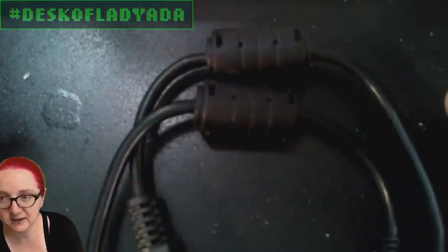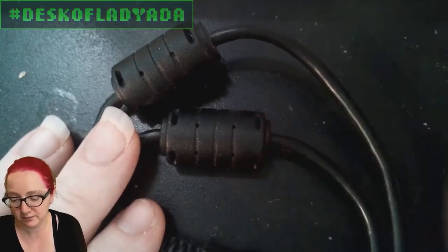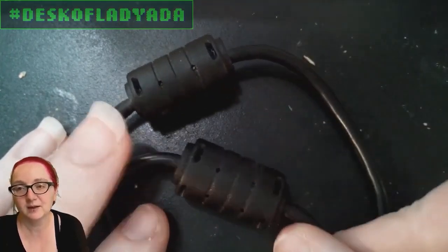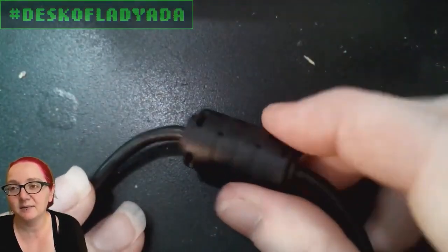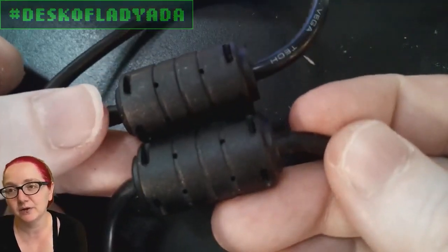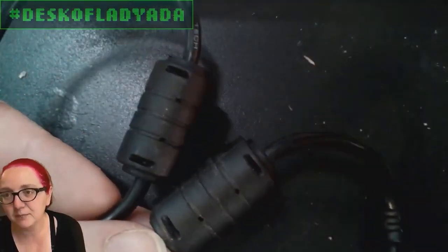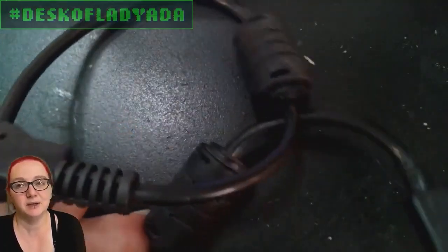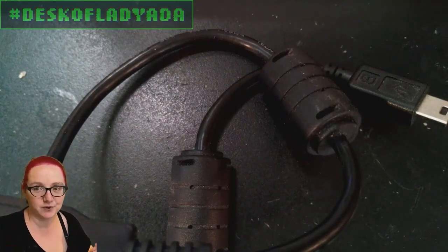So this is what you normally see — this is a USB cable. Although you don't see it as much anymore, maybe USB hosts or devices are better at reducing EMI in different ways, like inline resistors or lower drive strength. But this USB to Mini cable has a ferrite bead installed on both ends, which is pretty serious. Maybe it was required for the product this shipped with. These are molded in. In some cases, you want a clamp-on ferrite bead post installation, and you'd use test equipment to determine whether it's passing the EMI floor you're looking for.